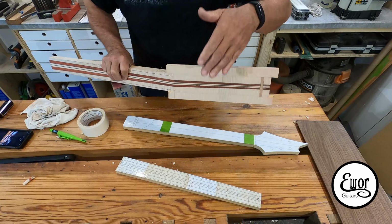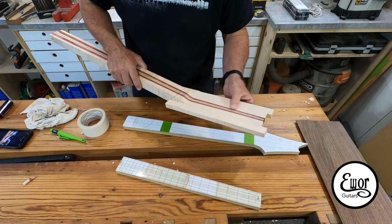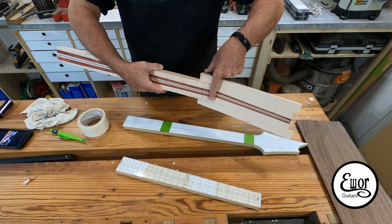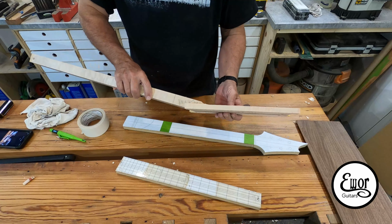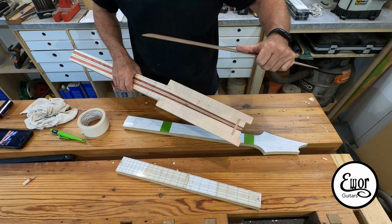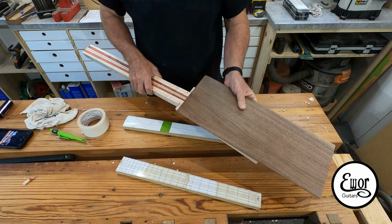I went ahead and after I surfaced this face of the headstock, I set my sander over there at about 9/16, and then I tightened it up a little bit and it went a little bit under. But so I've got this thing thickness really nice now, a little under 9/16. And you can see I ran a couple marks here, and I ran it right to here, which is basically going to be the headstock side of the volute. So when I wind up cutting this out, you'll see how that comes about. And by the way, remember we're getting this headstock veneer, which measures 3/32 of an inch right now. So it'll wind up getting thinned down because I still got the bandsaw marks I got to sand off of here. But that'll be my headstock veneer.